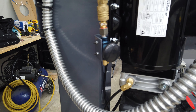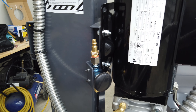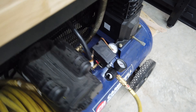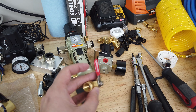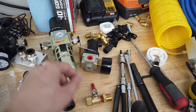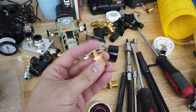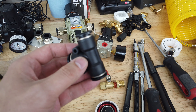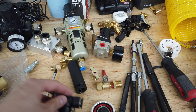I'd like to add another T and run a line down to the air locks. The air locks need about 75 to 90 PSI according to BendPak but no more than 125 PSI, so I'll give this line its own regulator just to make sure it stays in a happy range. That'll mean I can use both the hose reels and the air locks without disconnecting or reconnecting anything, and it'll also get rid of that tripping hazard. I'd also like to get a quick manifold setup, but in place of solenoids I'll just use ball valves for now. I'll open the valve between the compressor tank and the air lines and close it when done. In the future, a microcontroller that I'll program will control this automatically via solenoids. I'll also have one that bleeds air out of the lines, which will help draw moisture out as well. I'll direct this air through a silencer so it won't be as loud when the pressure dumps out all at once.